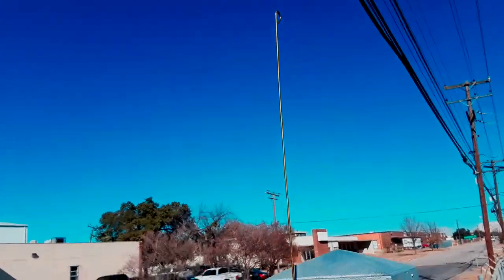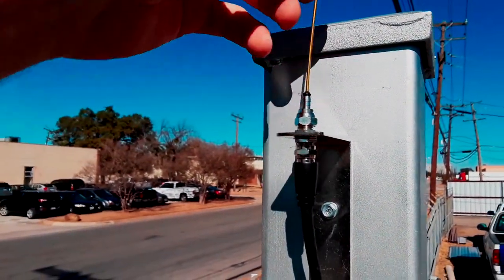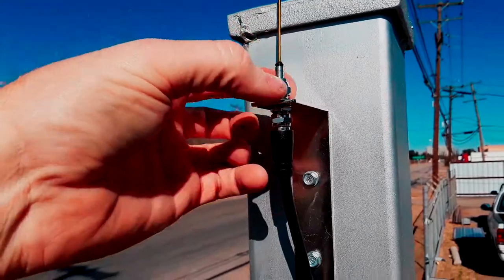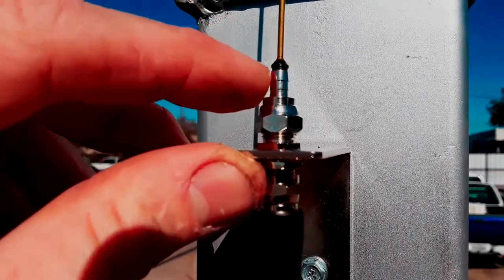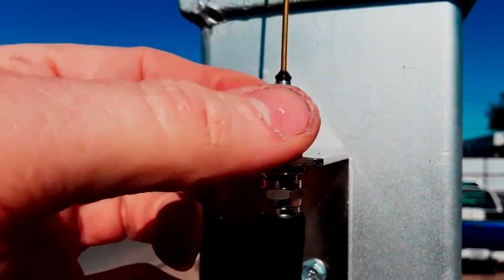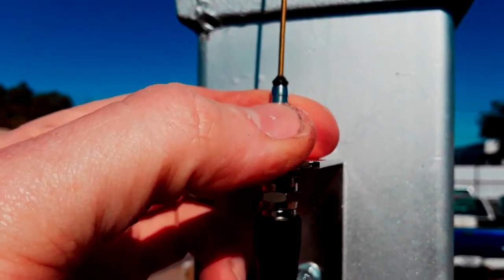Then we've got an antenna on top — tighten down the connection and make sure the antenna is actually seated in the female-to-female coupler. That has been an issue I've seen before: the technician puts the cable conductor for the antenna on there and screws it down, but it gets pushed up and out by the force, because some manufacturers don't use proper glue or adhesive. So it pops up a little bit — or a lot — to where it's just resting on the very top of the connector and not making good contact. We want to push the conductor all the way down into the female-to-female connector so it makes a good connection.